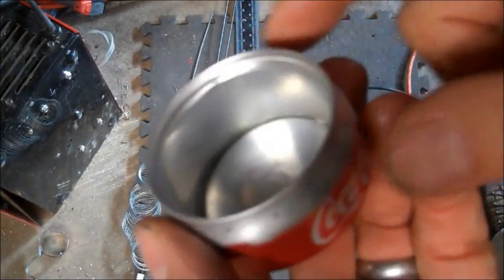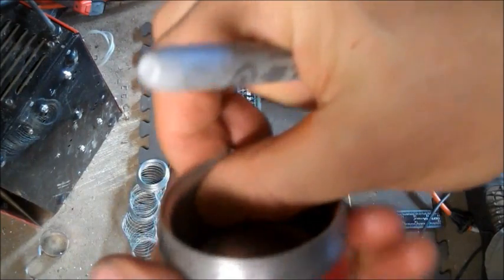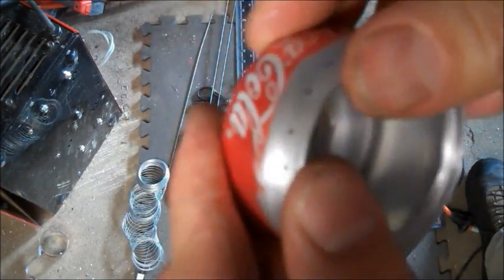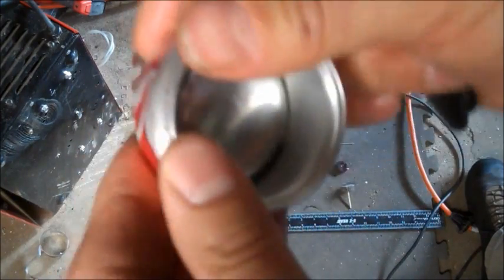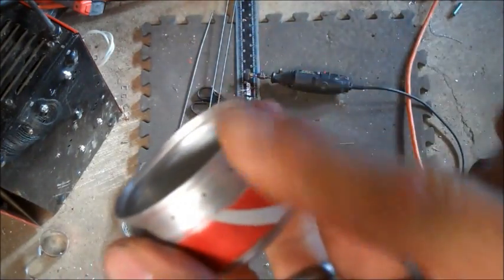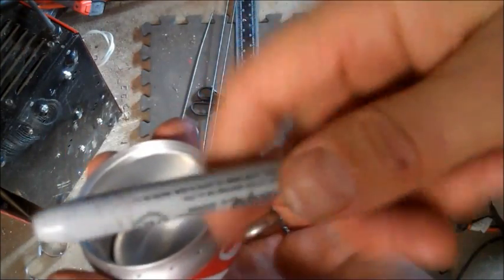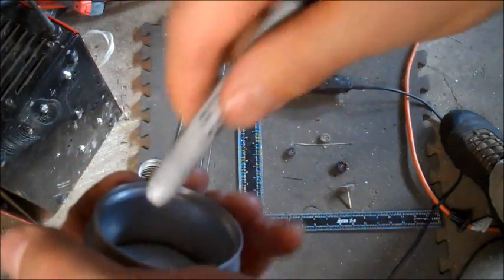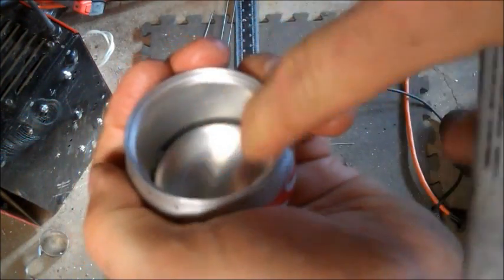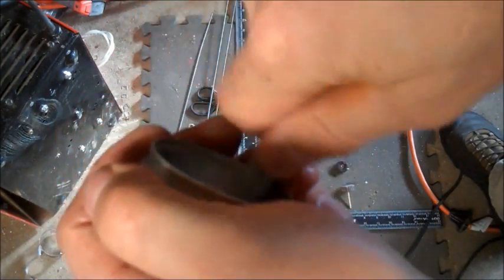Okay, the last crucial steps to complete the stove make a big difference. Go around with your finger on the inner side of that flashing, pressing towards the outer wall. And then make sure these two are clamped together as tight as they can. You want that inner flashing to fit up into that crevice as best as possible. When you've done that, take something like plastic, soft, and go around the inside, around that lip. And what you're doing is stretching that flange out to meet the flashing.